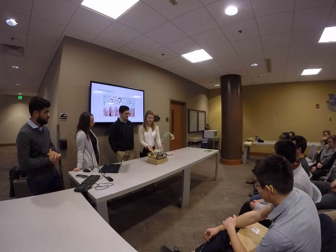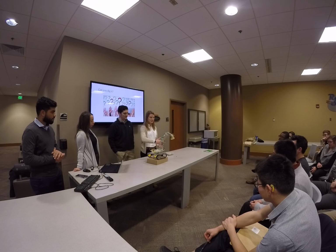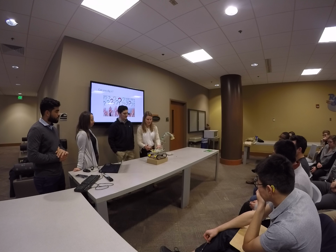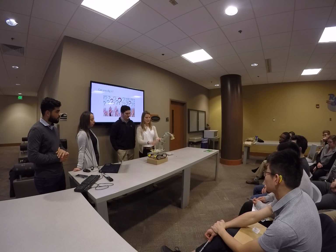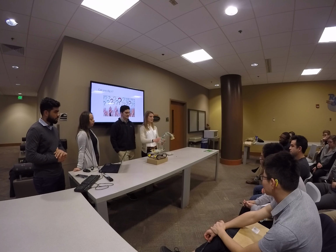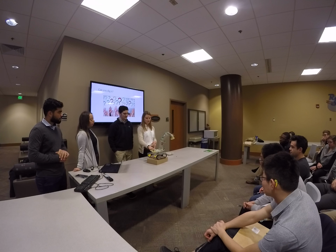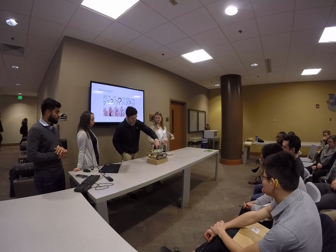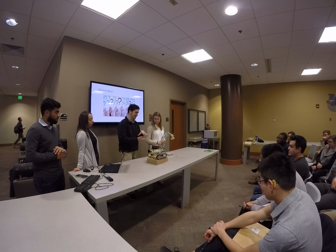So we thought that adding these rolling bearings would be enough, but as soon as you started to turn the arm, it would tip. What was actually happening is that the servo is connected and then it's just feeding through that hole in our base, so the servo was what was lifting up. All we did was secure the servo to this bottom base, and that was enough to secure it all. We also inserted a screw from the top plate into the servo so everything's held together tightly.